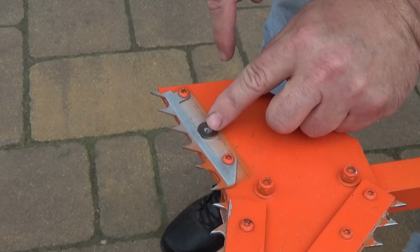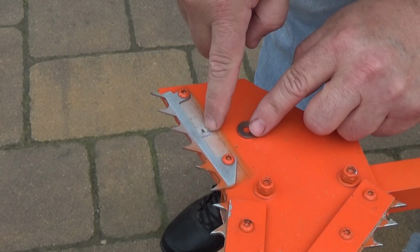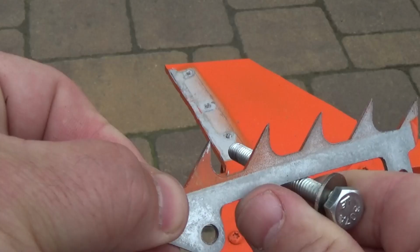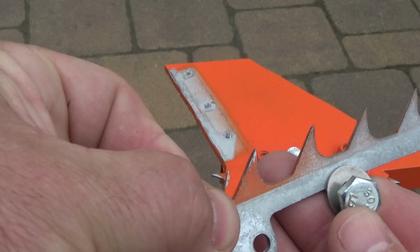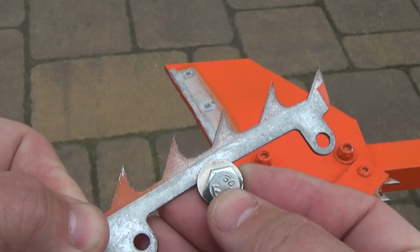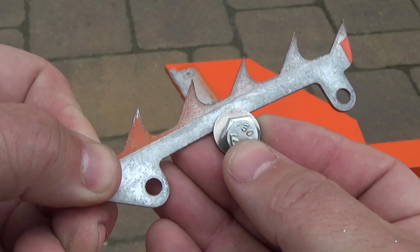My hole I have here is for attaching it with a plate on top, but your hole should fit flat against the dog. That way the washer will overhang on top of the dog and it clamps it down securely when you tighten it down with a washer and a lock nut on the other side.